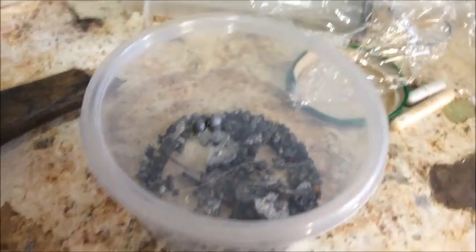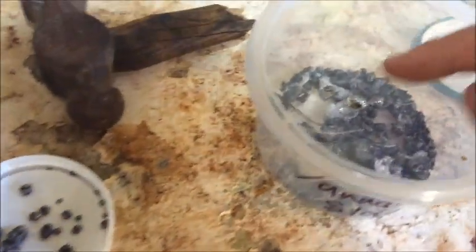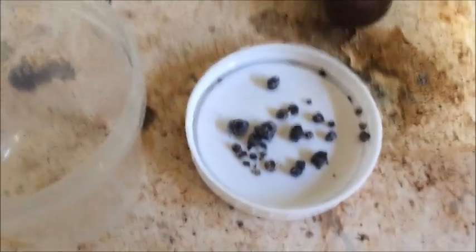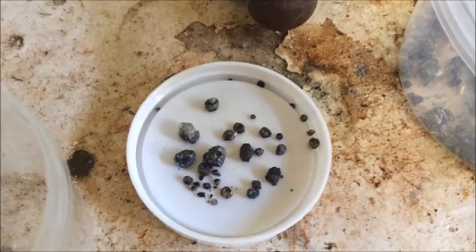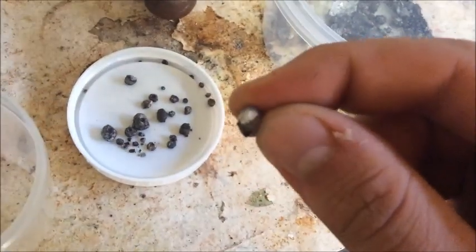You'll also get some lumps of aluminium, especially if you do this in an aluminium container like I did — which I don't recommend. They're very easy to chemically differentiate from the vanadium: just chuck them in acid and if they go nuts they're aluminium. In practice they're actually quite easy to tell apart from the vanadium as well. The metal looks substantially different — there's no colour at all and there's often a white oxide section on them.